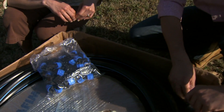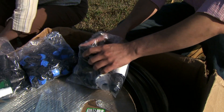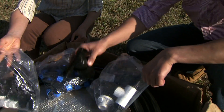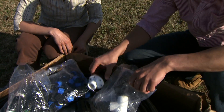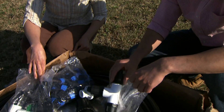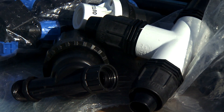There are also some pieces that connect to the hydrant. For our control unit we have a filter, which is an important piece to have to filter out all the physical parts. A pressure regulator — another very important piece — and some other types of fittings, T's, and adapters for the header and for the T-tape. Depending on how you want your system to operate, there might be a few optional items like a timer.